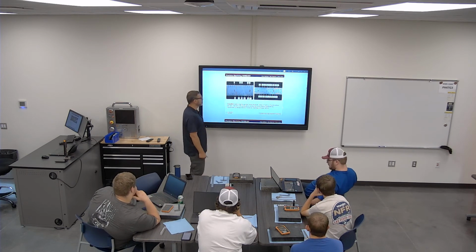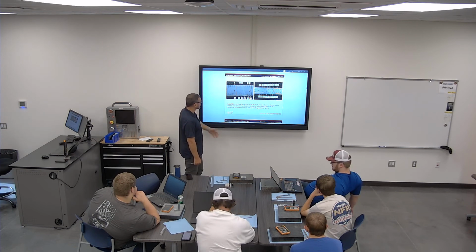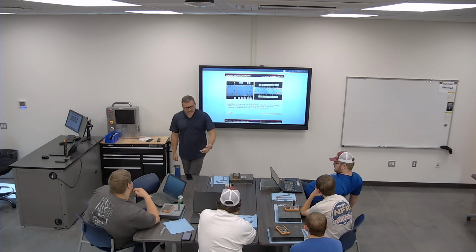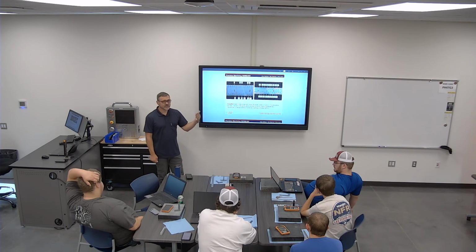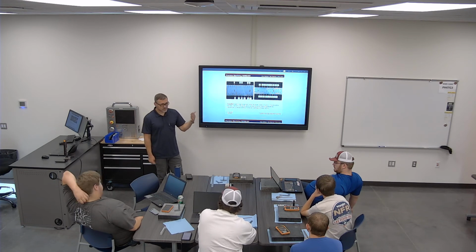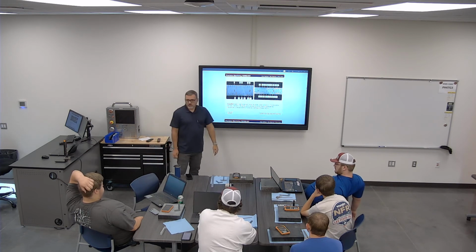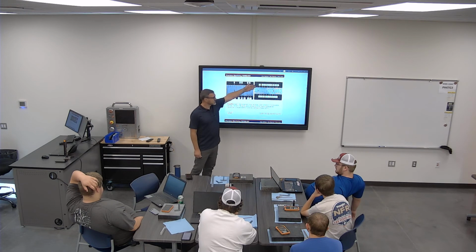So here is just some fractional reading on our scales and rules. This is an eighth scale up here, and to find 7/8, it is literally 8 marks on from 0 to 1 inch, and it's 1/8, 3/8, 5/8, because all the other ones, I'm skipping all the evens because they're reducible. What if we have a 16? This one's 16. So this is an 8 and 16. And so this is a 32 and 64th.